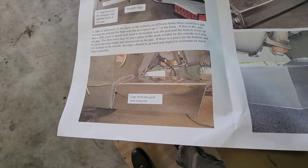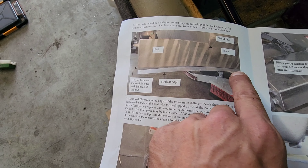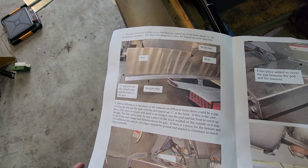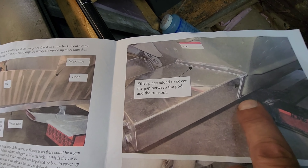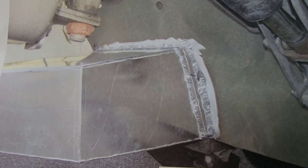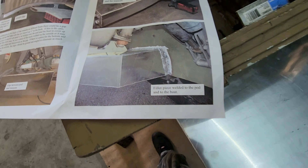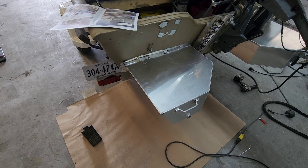It's important though — you've got to keep this straight edge correct across the bottom of the hull, otherwise the boat will not drive right. It'll porpoise. So in order to make that happen, we had to add these filler pieces. I'm going to send Beaver Tail some pictures of my welds — honestly these look like hammered dog shit. This is going to be a lot harder than I was originally anticipating, but we're going to get this thing welded up.